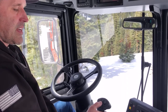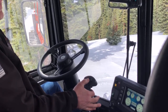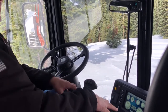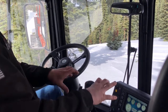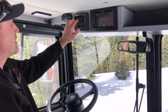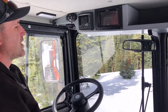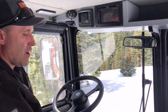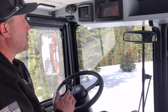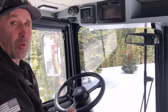The other feature is depth of cut, which is the center button. Pull the tiller switch with your index finger and run the center button — pushing forward rolls the tiller deeper into the snow, pulling back rolls it up out of the snow. Watch the tiller pressure indicator at the top of the MD3. If it starts getting over around 3,000 PSI, roll the tiller up to reduce pressure. This is easier on the machine, builds less heat, and as long as you're leaving a good trail there's no reason to overwork the vehicle.